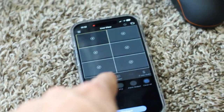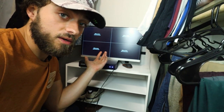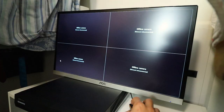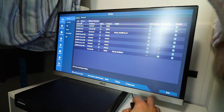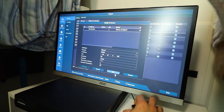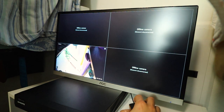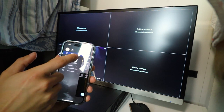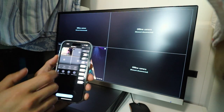With all these now wired up, I have two wired up to the kitchen and one wired up to my dining room. In a minute I'm going to show you exactly how I connected two cameras to one cable with the PoE system. This is where the NVR is going to stay. Now we need to set up each camera before we mount it. Go to menu, select a camera location that has not been used yet, press manual, select this one, exit. Now the camera is online. With this configured on the NVR, we can go to our phone, the app, go to live view, and add that camera to our live view.